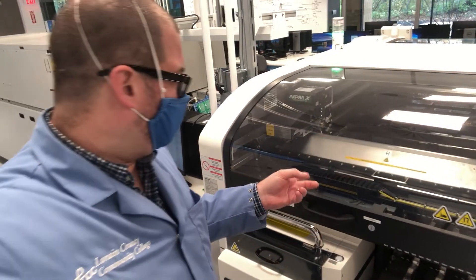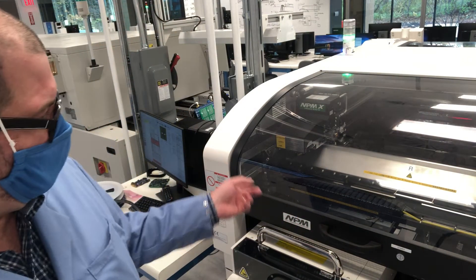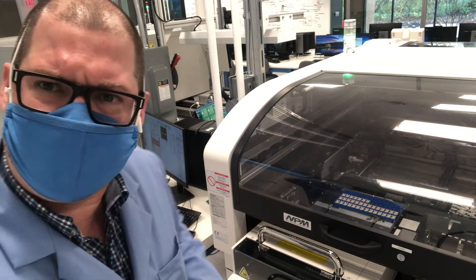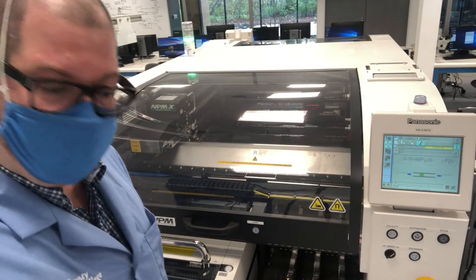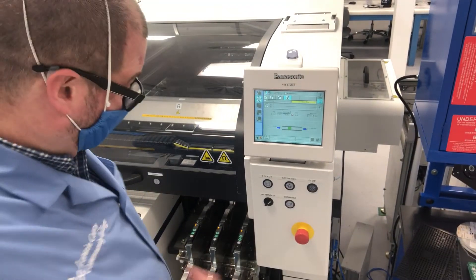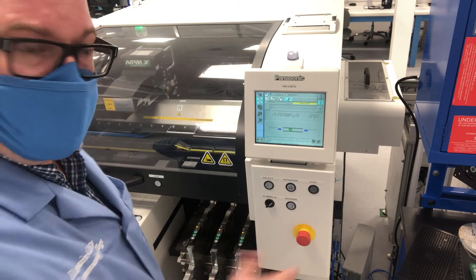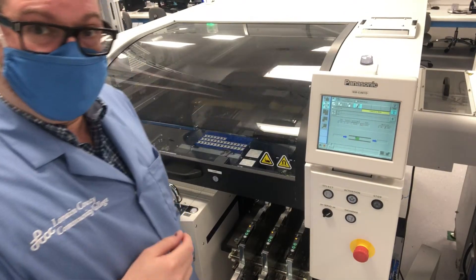If I wanted to take a look — you can see there's a little blue tray in there with some parts. There are three ways I can stop the pick-and-place system to get that tray out. One is hitting the EMO button, which is for emergency use only — don't do that. Another is turning the servo switch, a safety switch that cuts power to the electronics for servicing the machine — I don't want to do that either.